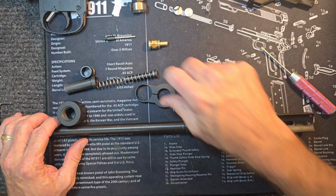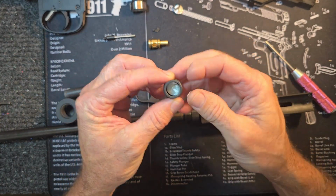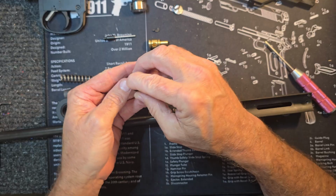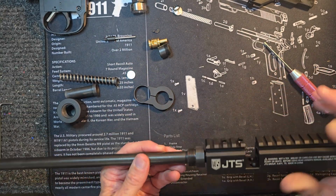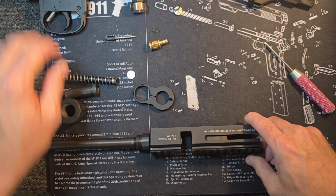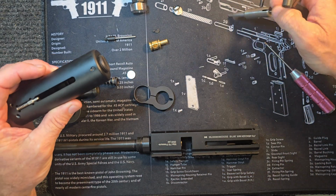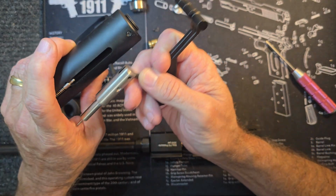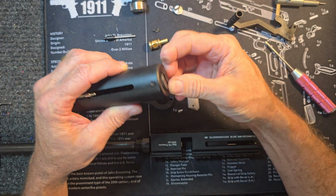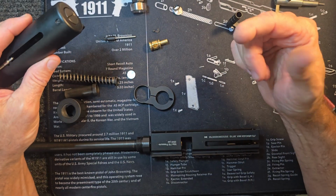The next thing I have planned is we got us a little 1/8 inch spacer. We're going to drop in there so that we'll put a little bit of preload on this spring, on the hammer spring. Because what I have found is that this hammer, when you have this in here, it will hit against that somewhere. I forgot how it's working now, but it limits the amount of, so you can't cock it. So if we can get preload on it before we even get this in here, we're better off.